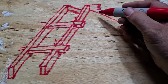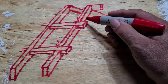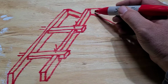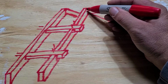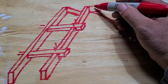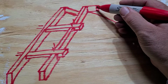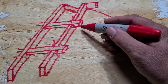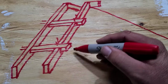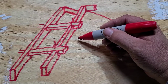And then when you put your fascia board up here, you would put your fascia board flush with the tops of these outriggers, and this center block's got to be held down just a little bit so the corners of it don't get higher than the top of the truss. So you'd hold it down, there'd be just a little bit of gap on the top, but it would be lined up with the top chord of the truss. So your fascia board would nail or screw out here flush with the top of these with the same cut, and then that would give you your overhang on the gable end of the wall.